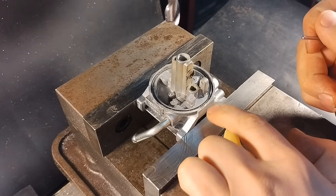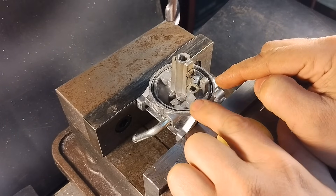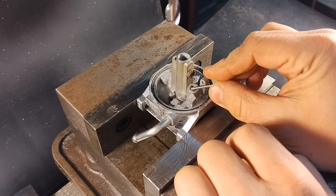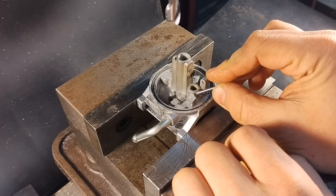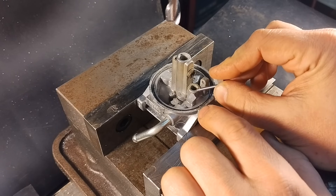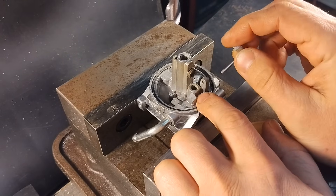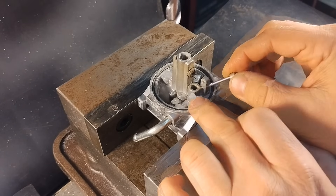The first step is going to be to mill this off flush with the larger meat of the casting. That'll give us something to measure the height off of to figure out how long to make the replacement part. I'll probably use a scrap of aluminum. I'm going to try and mill this off — I'll end up kissing this cylinder here where the needle goes in, but I'll make sure not to take too much meat off it. The main problem would be if I create something where the needle can hang up on it, but the needle seals down lower. I think the seat is down below this surface.